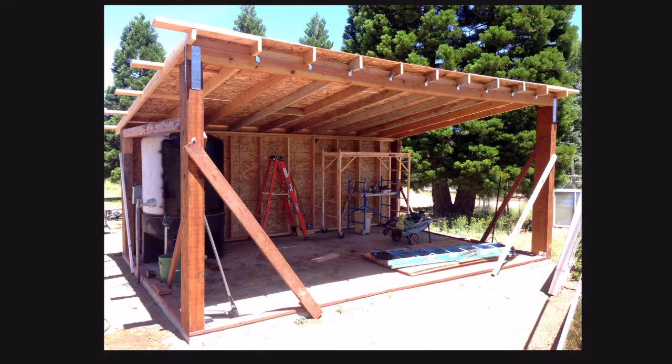Well, for simple purposes of a load-bearing wall, we're going to use this greenhouse example. So if I'm standing on the roof, or I'm a really big snow load, I'm exerting downward pressure on this big flat roof surface, which in this case, you can even see is bowing this beam that is a little insufficient for the load without any support underneath it. So it's taking that downward pressure and transferring it into empty air. So this is a load-bearing wall.